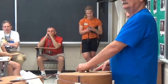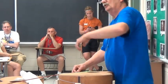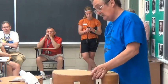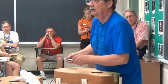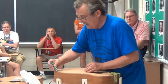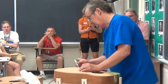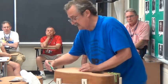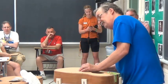From here to here, I can pull, because I can pull it right into the channel. When I get to the waist, I have to push, because that forces it into the channel. Now, I can literally run my glue all the way over to here. Ultimately, you're still keeping all the strips proud of the top surface of the guitar. If they aren't proud, I want them reasonably close, because my tops are not the final size. I'm going to hand sand them to the final depth. I always leave about probably 5/1000ths or so.